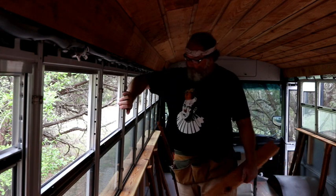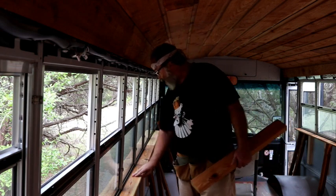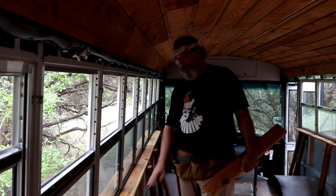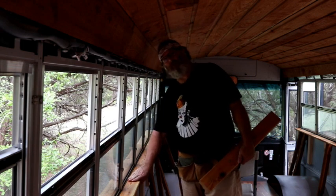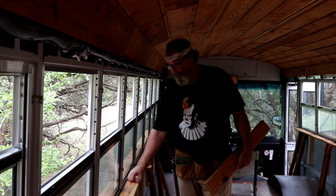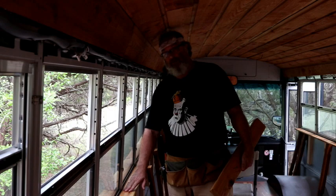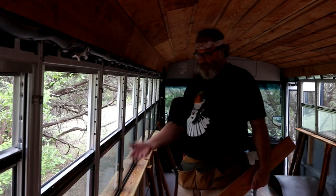This represents quite a bit of steel and aluminum, and it's not real pretty. You can see I've put in window sills already. The sill just sits on top of the square top of the wall nailers. It's glued and with four nails in it. And this is a piece of just 1x4x8 milled cedar. I cut a chamfer into the side, squared off all the ends, sanded them down, and Pat put one coat of linseed oil on. They turned out pretty well. They've got a pretty nice hand and they feel pretty good, and they actually look pretty good. I pulled the grain right out of them.